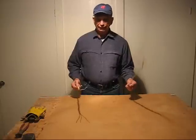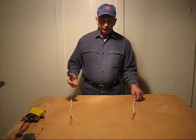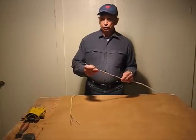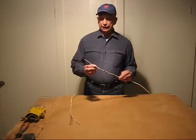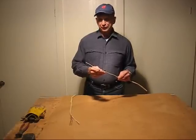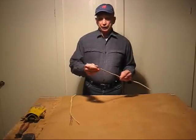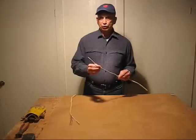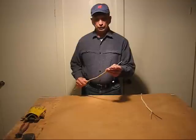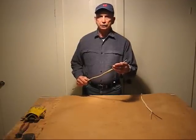The reason it's necessary to use the right wire on the right circuit is to avoid a fire hazard. For example, a 14-gauge wire, if it is fused with a 20-amp circuit breaker, that means it can draw 20 amps before the circuit breaker pops, shutting off power to the circuit. But the wire itself is not designed to carry 20 amps of power — that's what 12-gauge wire is designed for, to carry current loads greater than 15 amps but less than 20 amps.